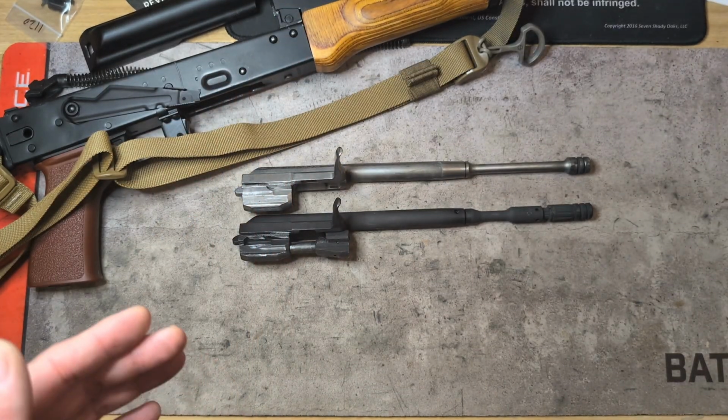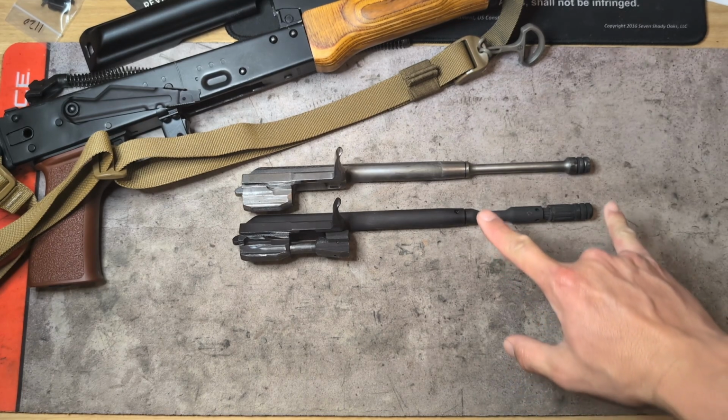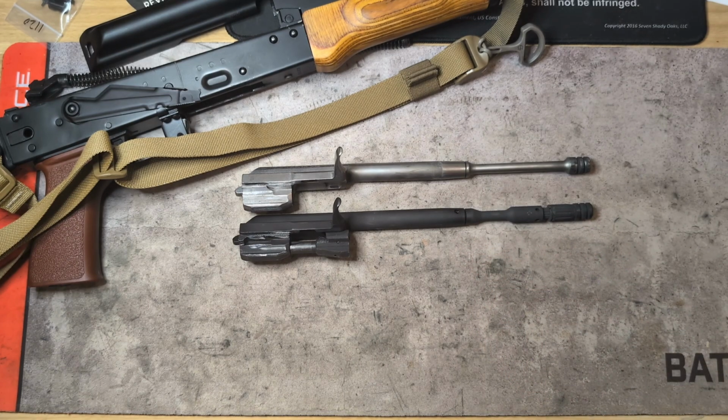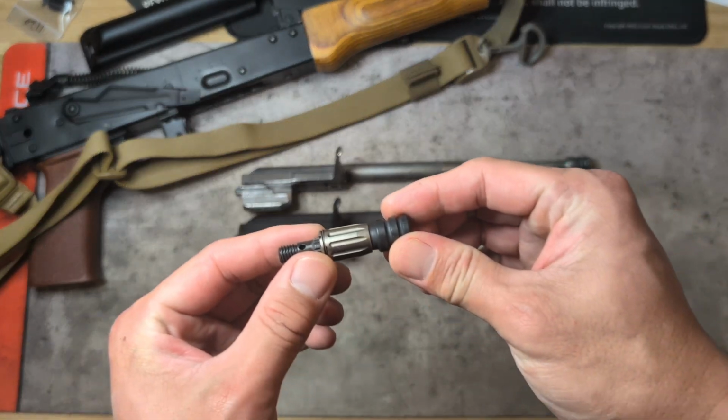So anyway, got back to the house, went ahead and took some measurements based on K&S's guidelines, and come to find out that what I was measuring between the working length and then the whole length was really more along the lines of the AGP-A-23S, which is the one that's designated for the C39 V2 AK, which is, I believe, a Century International. Reached out to K&S, asked them about that, sent pictures to them with my digital mic, kind of asking to confirm. One of the things also that I did notice is that this is the piston alone as I received it from Arms of America.